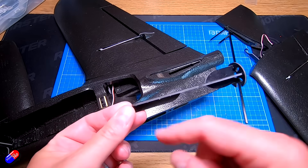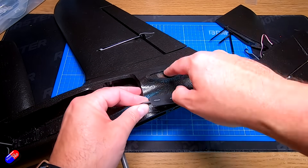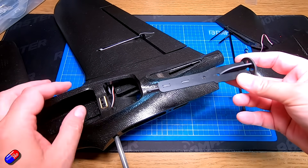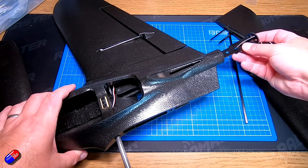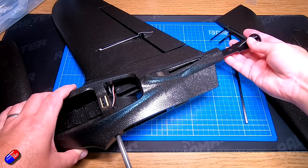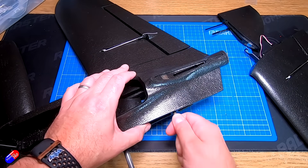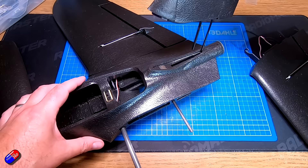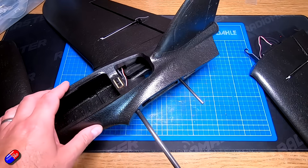And this is why I've done the tail adaptation. The motor is going to mount on here and the motor wires run underneath. There is space at the top which is where you could put your receiver with the antennas coming up in here — though I'm probably not going to do that as I'm using a diversity antenna and would prefer a V configuration. With the way I've set this up, I can change the motor in the future. All I need to do is slide this back into place, put the rearward spar into position — that locks it — and then the tail provides additional locking for both stability and stiffness, ensuring the motor mount isn't going anywhere.